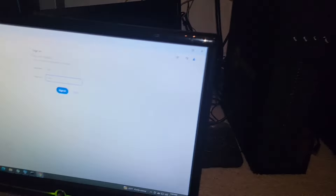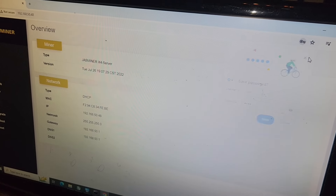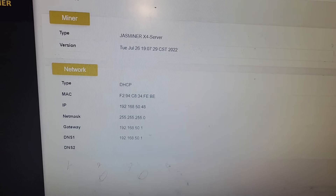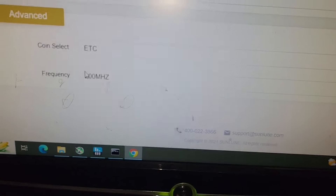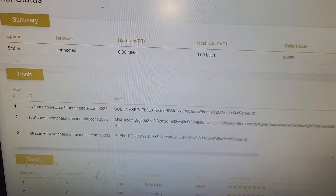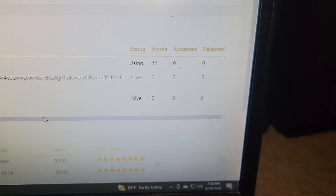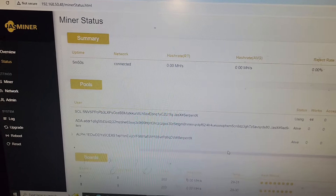Believe it or not, I did not have to flash or put a micro SD card in there to flash the control board — everything was already in there. Probably do need to update it, but logging in with the default password root/root, I already had the miner set up. The reason it was flashing red is because there was no mining config set up. Going to the miner section, all my pools and wallets are configured. We're also on ETC hash instead of ETH hash at 200 megahertz, and we are running like a charm. The hash rate hasn't shown up yet, but scrolling over to the right we can see 44 works, zero accepted — so we're just waiting to confirm some shares. The fact that we're even able to log into this machine is a huge success, because originally after the lightning strike the NIC would not power on or show any signal or data transmission, and we weren't able to connect to the miner — it would just say red fault. Everything is back up and running.